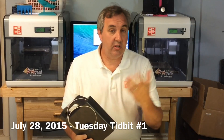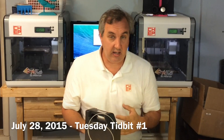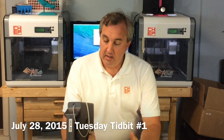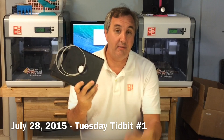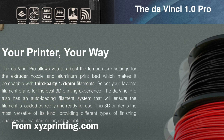I was really frustrated with the whole software blocking and the cartridge thing. I reflashed Repetier, just like many others, to get more control for other plastics, different temperatures, and different settings — that's what we need to really be successful at 3D printing. And apparently XYZ listened: they said 'you asked and we listened,' and this new printer allows us to adjust temperatures, different settings, and use third-party filaments.